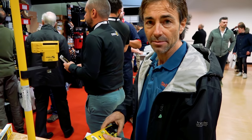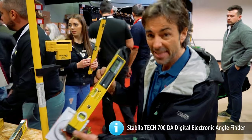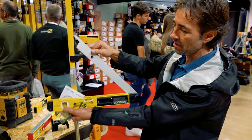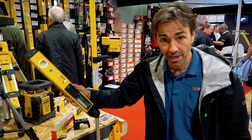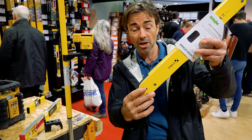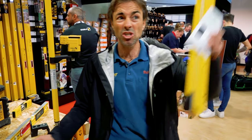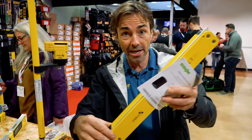This inclinometer is not dissimilar to what I use. It's for the roofing guys out there. People ask me how do you know what the pitch of a roof is? This is an inclinometer — once it's set up it will tell you the pitch. It also works the other way so you can keep it level and offer it up and down the slope. However, they're not foolproof. These are incredibly accurate, but if you put this on an existing rafter — you've got the ridge, you've got a purlin, you've got the plate, and in between everything bows. So if you put it on the wrong spot, it will say 33 degrees; you go up the rafter to the purlin, it will say 37 degrees. So what you need to do is use a straight edge from purlin to plate over the top of the rafter, taking out that undulation from the ridge to the plate, then use your inclinometer and you're going to get exactly the right pitch. Sometimes it can vary 3 or 4 degrees in one rafter based on that deflection. So that's a good little tip.